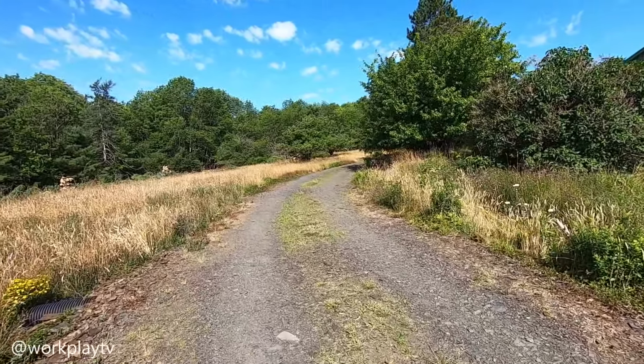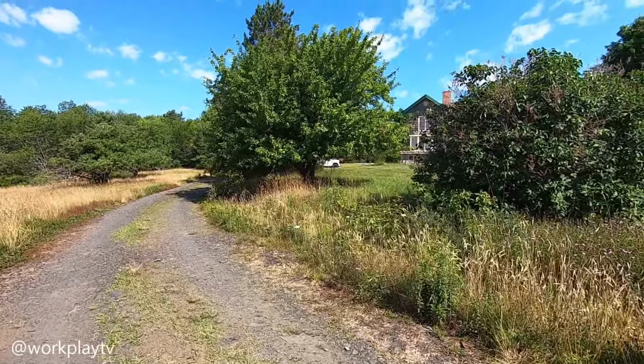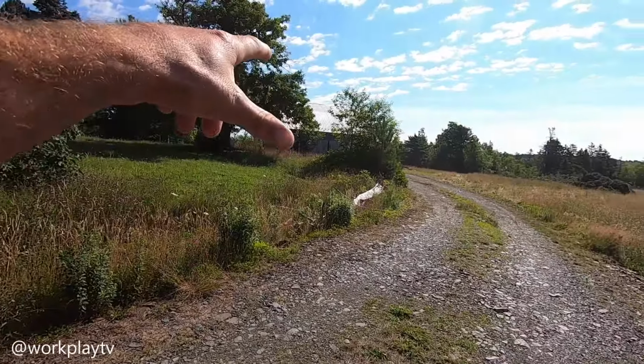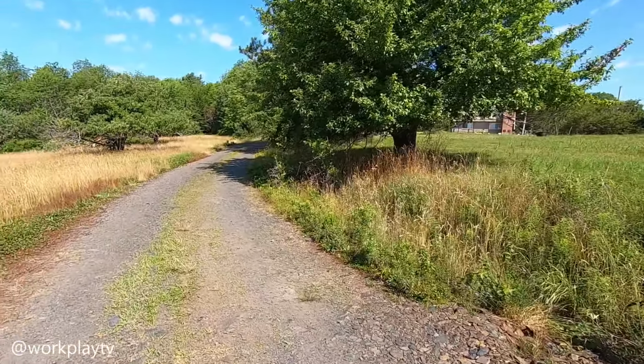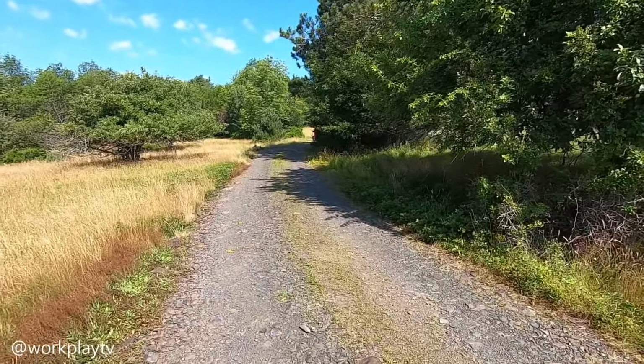It was a very busy day yesterday. So I'm gonna get in the machine. I'm gonna start exposing that corner of the foundation. And then I'm gonna come over and dig around the corners of the foundation of the barn to see how far the footing goes down, and then figure out what I need to do to shore the barn up.